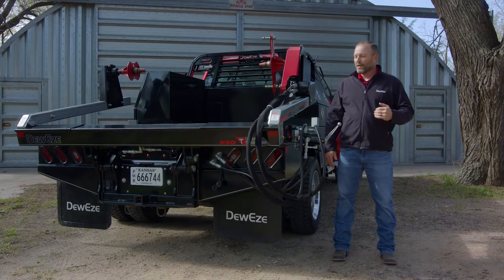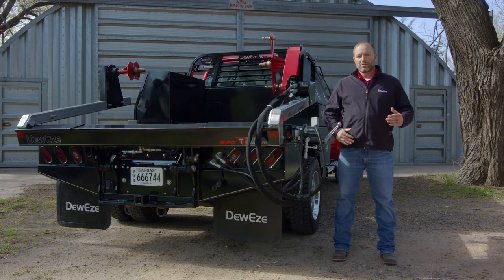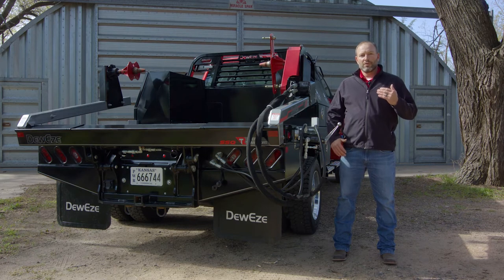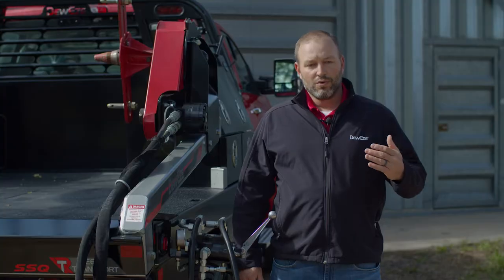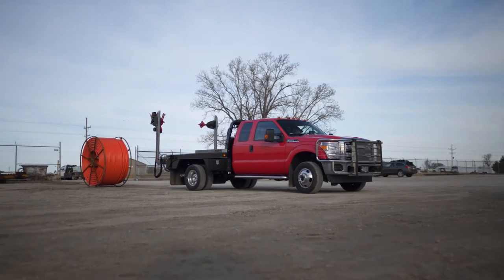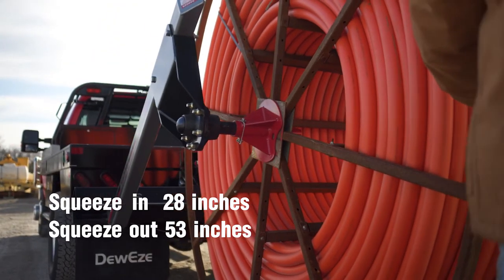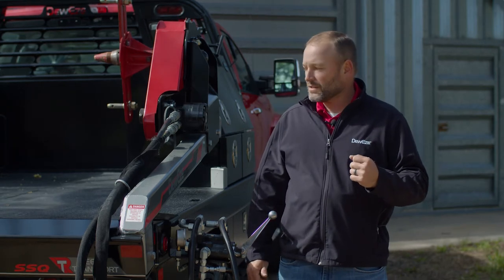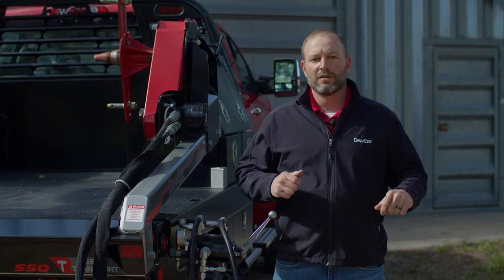Now I'd like to walk you through the why behind many of the features you see on this product. When I mentioned earlier we're talking about replacing a self-loading reel trailer, we accomplished that via the arms on this bed. We have a dual lift, hydraulically operated arms that can lower down and pick up your reels that go down to 28 inches wide all the way out to 53 inches. We also get questions about why the arms go in and out together — what we call the parallel squeeze.